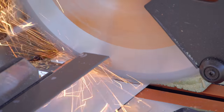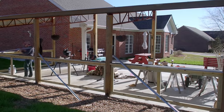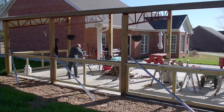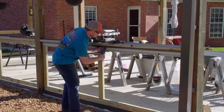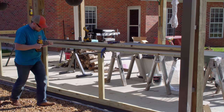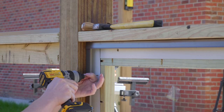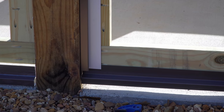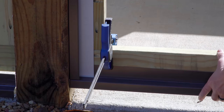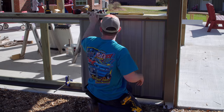On the next good day of weather I started by cutting more of the j-trim. The metal installation is much quicker than the wood. First, the top j-trim piece is installed and I used a clamp to hold it in place while I punched holes for regular wood screws. I didn't go crazy with wood screws here because the panel screws will also secure the trim later. The vertical j-trim is added next, making sure to tuck it into the top piece, and on the bottom a piece of base trim is added. I prioritized the view from the road, so the panels are installed right to left so the overlap is away from the main direction they'll be seen from.